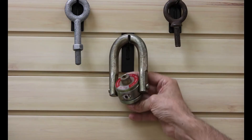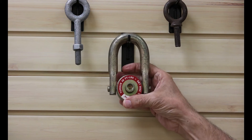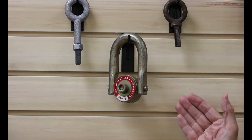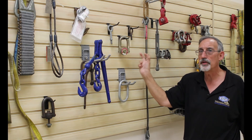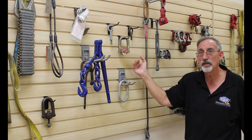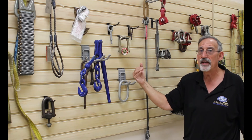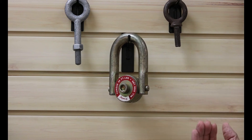The other problem with installations is simply torque. There's a torque requirement for all swivel hoist rings. This torque gets the proper tension on the bolt and proper compression on the bushing when installed, to achieve full rated capacity at any angle of loading. On this one, the torque is only 28 pounds.